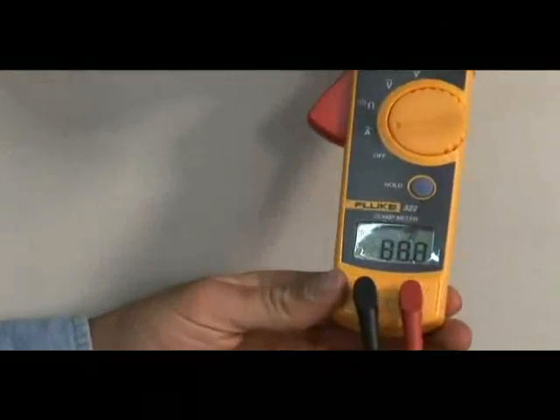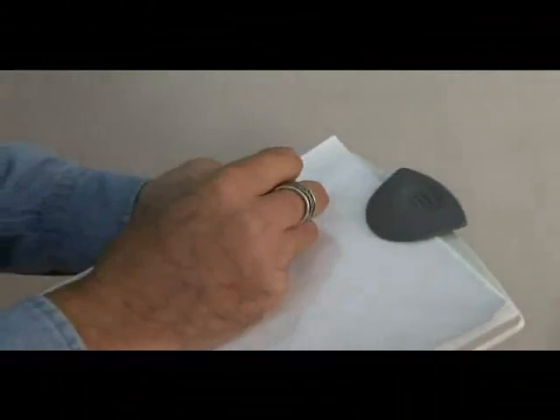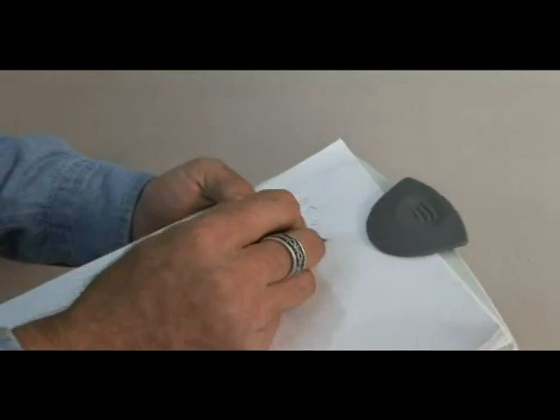Check the amp meter to see that the system is running at less than 96 amps. The system will shut down in approximately 5 seconds, which will be long enough to get an amperage reading. The LEDs will indicate either under or over current prior to system shutdown. This is normal.